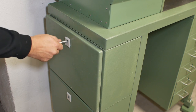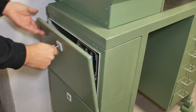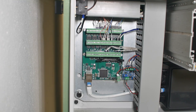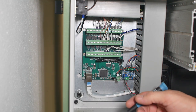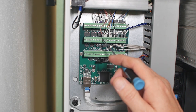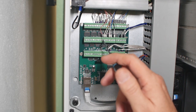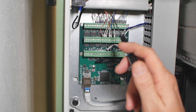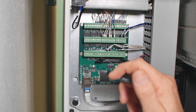Last week, I wired up all the switches and that jog encoder, but I screwed it up. Yeah, the problem with my wiring was a pretty typical for me combination of not reading the manual and not understanding the manual. I was assuming I can pull +5 volts off this row, feed it through a switch, and then back to the common, but yeah, that's not how it works.